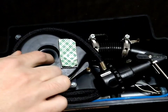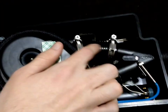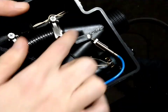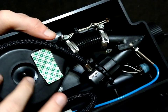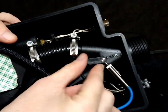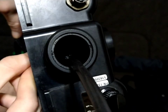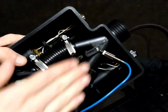To start off, we have the motor blower, which is the standard motor blower from the C420 — the one main component recycled from the previous PAPR. That is hose-clamped to a piece of what looks like pool hose, just plastic hose, clamped onto the Y-splitter I mentioned. This would have originally been used with a C420 attached to this end. You also have this little pneumatic actuator: when an SCBA is plugged in and turned on, the pressure goes through this little tube up into a piston, pushing a lever that moves a flap inside — covering the blower so no blower air goes to the mask while the SCBA takes over.